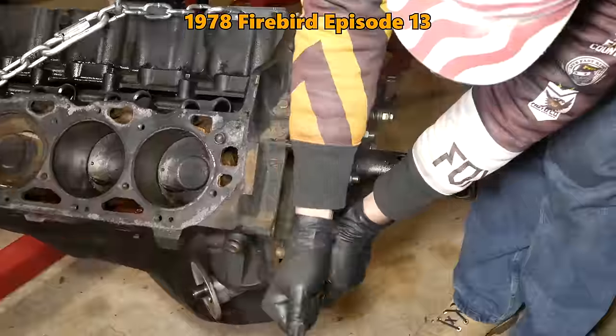Up here, there's a lot going on. I haven't painted the head on this. I'm not really worried about it. We've got holes drilled so you can drop in the pin and lock the handle in place. And that's especially important with these other sets of holes, which are for sliding it all the way out here and locking it there so that we can tilt the engine with a lot more leverage and also not have this sliding all over the place. When you do flip it over, yes, the pin is facing upside down. If you really want, you can put a nut on the other side.